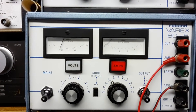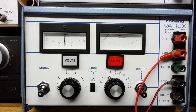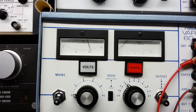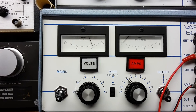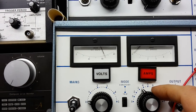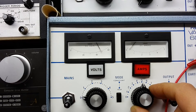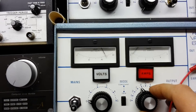There's an initial spark because the capacitor is still partly charged. When it gets to 50 volts that amp light should go out and it should show no current draw at all. I can actually see current draw on the meter. Look at the voltmeter — see it falling back. It's only got to 42 volts, 44 volts, and it already needs more current. It's drawing 200 milliamps, trying to take it to 50 volts. It's drawing half an amp. I'm not going to go any further than that because I don't want this cap to explode in my face.